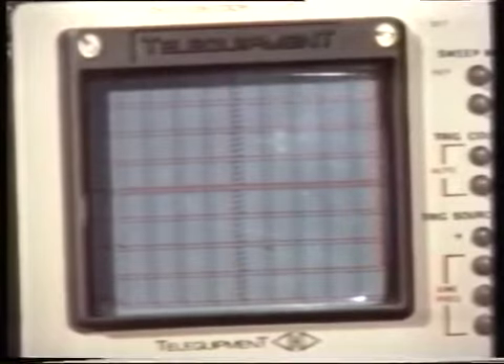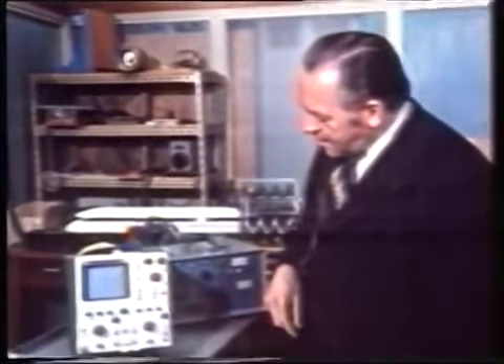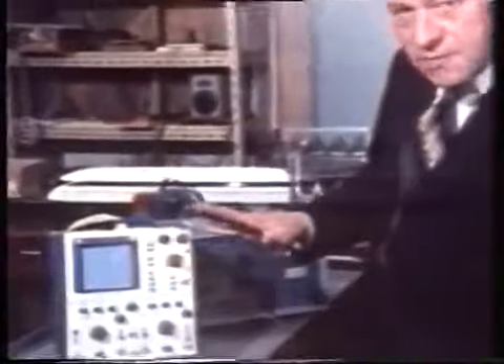Look at this oscilloscope — you see a spot rising and falling. That spot is really measuring the amount of current that flows in a wire. When it's above the middle line the current flows one way, and when it's below it flows another. Now I've slowed this down to show you what is really happening, but in your house you have an electricity supply which goes much faster up and down — it goes up and down 50 times a second.